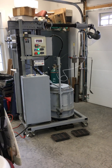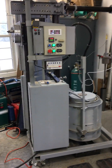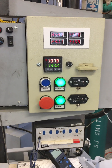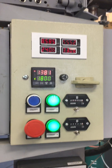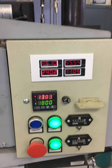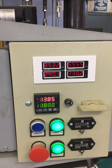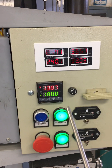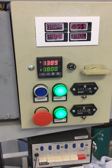I thought I'd give everybody a walkthrough of my rig since I haven't done that in a while, and I just went through revamping some of it. It's an eight and a half kilowatt two-coil resistive coil furnace — a glorified kiln, if you will. The white panel meter on the top has voltage, current, power, and energy consumed totaled over the course of the melt. I set it for 1800 Fahrenheit, and you can see on the PID it's making its way up to that right now.